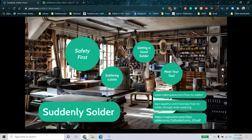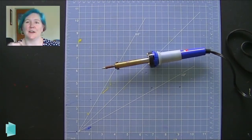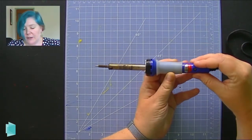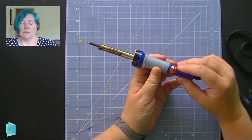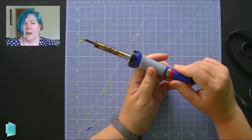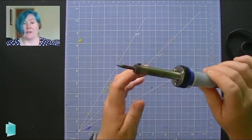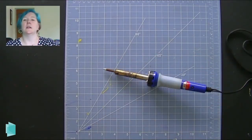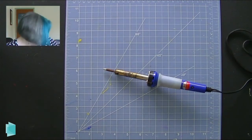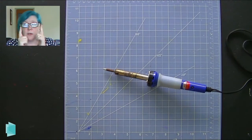So that's the basics of soldering — why don't we actually put this to work and make a project. Welcome to our document camera. I've got a very simple 25-watt soldering iron here — great for a beginner. Wattage really just affects how fast it heats up and what temperature it can reach, so this will get over 800 degrees without a problem. I always want to do a little inspection before I get started and get my goggles on — always safety gear first.